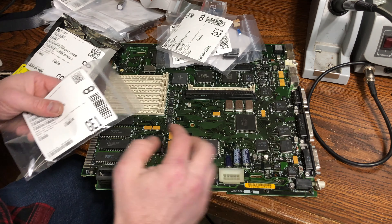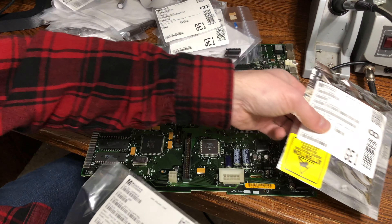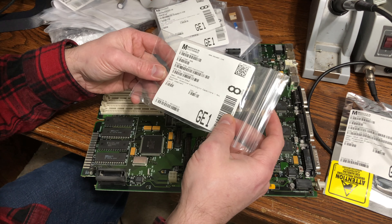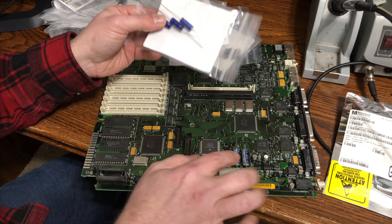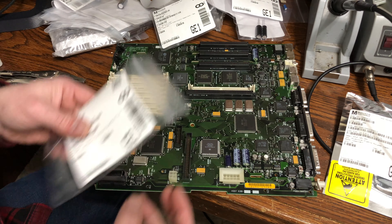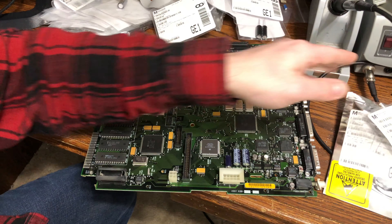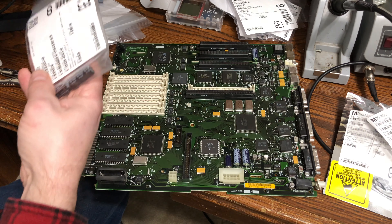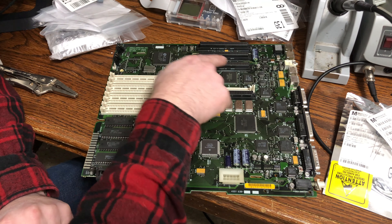This has C14 and C15 on it. This one says customer part number C2345, so this is definitely motherboard capacitors. This one does not have a customer part number, but I think this is the 16V 470uF one. We're going to replace these two, and I got another one back here — that's why there's three. My C14, C15, and C8 are not written on this package. These are all power supply capacitors — I don't think I've got any other electrolytics on this motherboard.